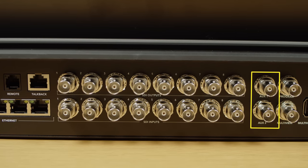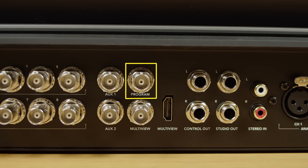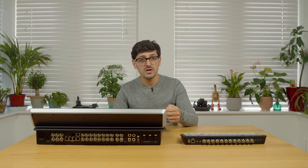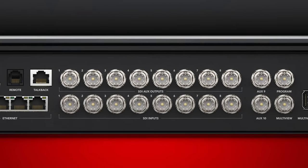Now let's talk about some of the differences, starting with video outputs. The ATEM SDI Extreme ISO has four configurable AUX outputs. The ATEM Television Studio, on the other hand, has a total of 12 SDI outputs, but only two are configurable AUXs. It then has a dedicated multi-view SDI, a dedicated program output SDI, and eight fixed camera returns that send program back to cameras for talkback, tally light, and camera control. I personally would have liked those eight camera returns to instead be eight AUX outputs, like Blackmagic did on the new 4K model, giving extra flexibility.